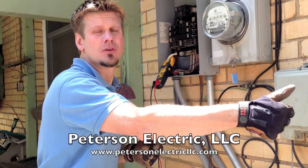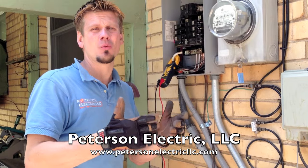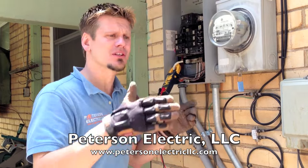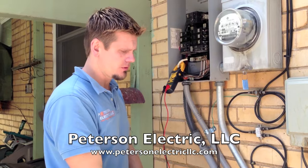Or you go to the bedroom and the living room turns on. It shouldn't happen that way with a decent home with good wiring. The reason it's doing that is because the neutral is lost and the circuit is looking for anything to return on — whether it's a ground or another neutral, it will still find its path to earth.